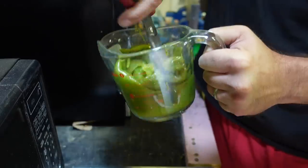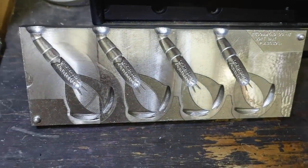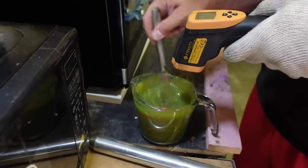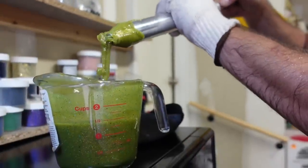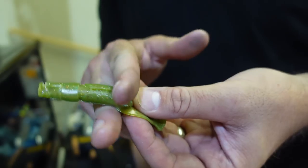Out in the garage, I'm going to cut up some of this chartreuse green — this is a remelt. Here's a look at the new mold, the Hatchet Craw from Dual Molds, a four cavity mold, nice and shiny. Here's a close-up of the claws — going to have a ton of flap on them, nice wedge at the end. Good looking little mold. Now as I get this warmed up, got it close to 360 with the remelt, we should be good. Go ahead and start shooting some of these in there, and always remember to top it off because as it cools it's going to suck some of that plastic down. Take my excess, put that back in the pyrex, and we're ready to go. As we open up the mold, you can see these shot nice and clean — perfect green color. I love the claws on there.